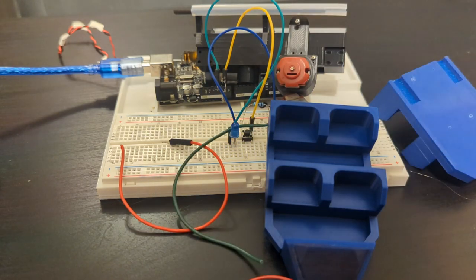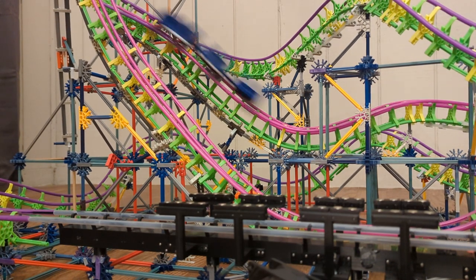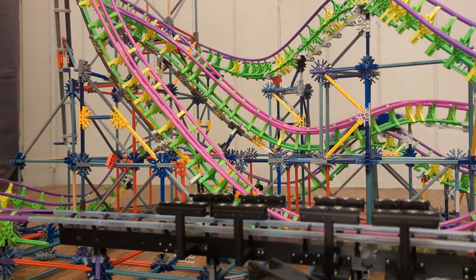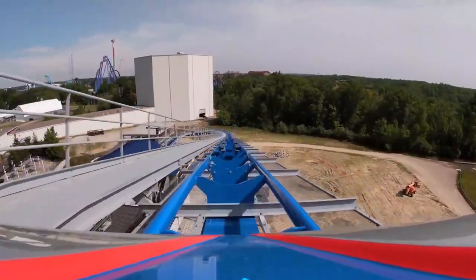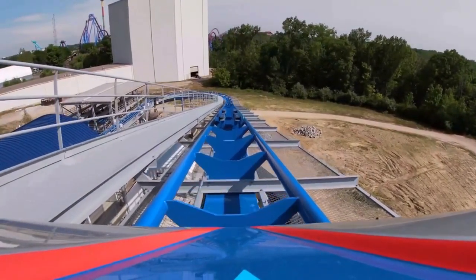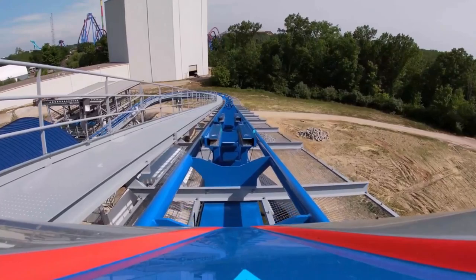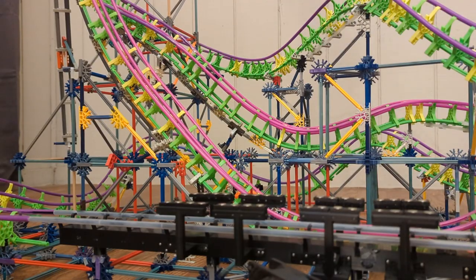No problem. What were you thinking? For my project, I wanted to create the magnetic braking system for my coaster. Magnetic brakes don't require any power and provide a non-contact braking force. Magnetic brakes aren't actually able to stop a train completely, and this challenge is where I plan to integrate it into my coursework. The brakes would be set up to slow the train most of the way, then I would use wheels on the track to completely stop and hold the train.